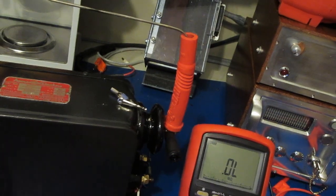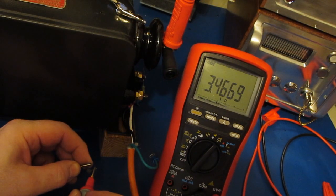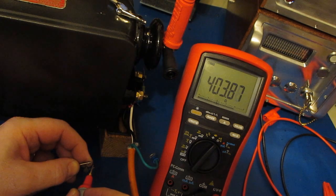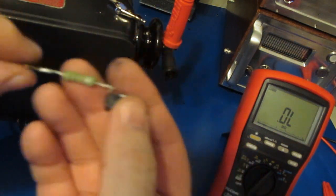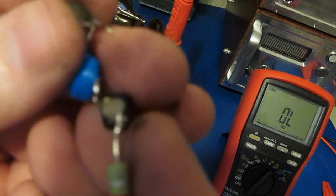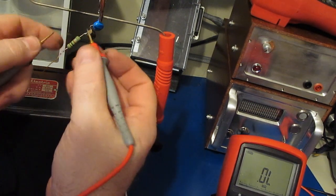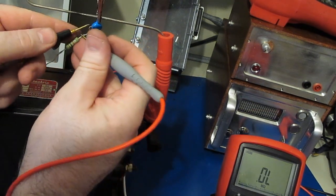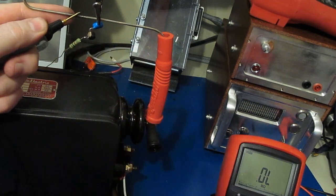She's hot — fingers are helping to cool it down. Last time we saw 440 ohms, and we definitely changed it again: about 404 ohms or so. Here I have another one — just the 1K surge-rated resistor — that came out of a higher-end meter. Should measure these before doing anything. This should be roughly 1K: it's about 933 ohms. The PTC is again about 1.3K, and the MOV should be open.